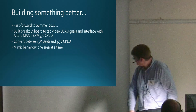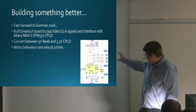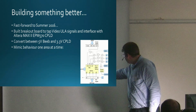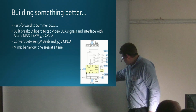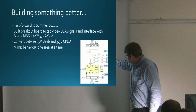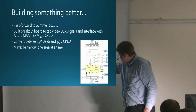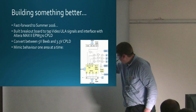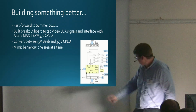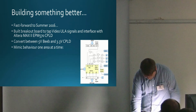And so this is taken off the wiki. This is essentially the main function. So you have the control register, there's the palette register, and basically the shift register. You're getting data in, and then you're outputting the red, green, and blue. There's some other stuff going on, the cursor, which is quite tricky. This is the flash bit I mentioned. You see that this doesn't appear on the outside. You can only get at it. That's why you have to mimic at least some of the video ULA. And that's the thing, those 4 bits there are where you get your 16 colours from.